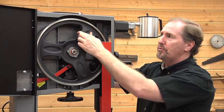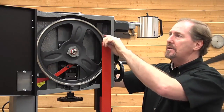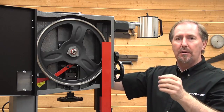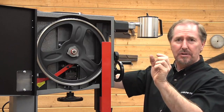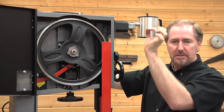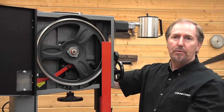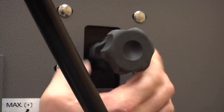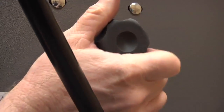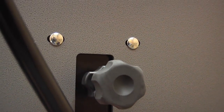I'm going to rotate the blade and adjust the knob to walk the blade forward until it's centered on the wheel. The bandsaw tires on this one are just ever so slightly crowned — you're going to run all your blades right in the middle of the crown of the tire. On a wider blade like this, you'll have it centered on the wheel; on smaller blades, they center themselves right on the crown of the tire. Here's the tracking knob and the lock knob. Loosen the lock knob first. Rotating the tracking knob counterclockwise walks the blade forward on the wheel; rotating it clockwise moves the blade backward on the wheel.